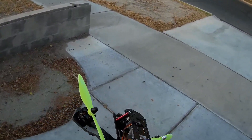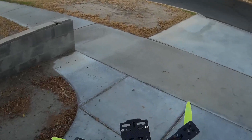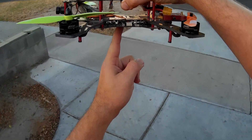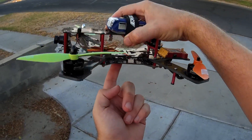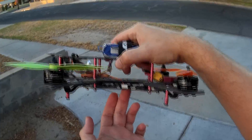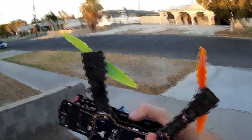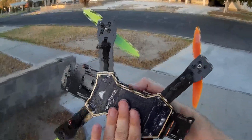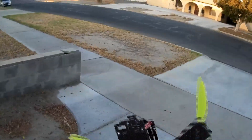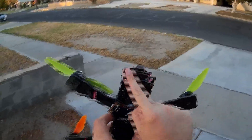One thing I've noticed is the board gets kind of warm. There are two 7805 linear regulators in there — I don't know if you can see them — and it looks like a three-volt regulator next to it. That's what's putting a lot of heat in there, and it's all concentrated right around that area.